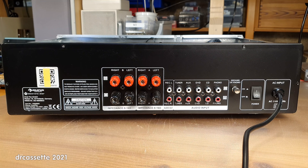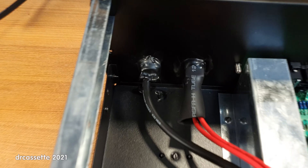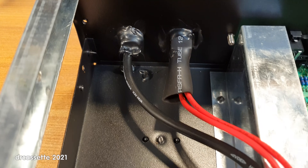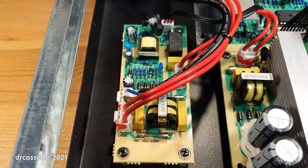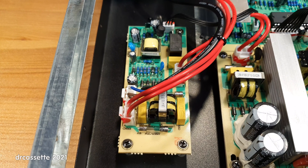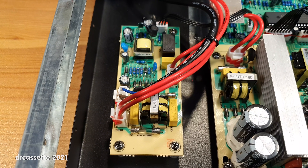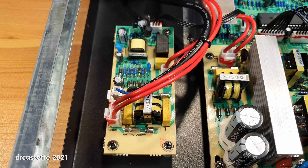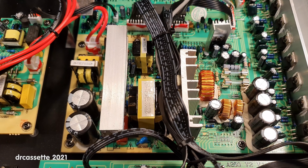Because this device is only from 2014, everything is nice and clean inside. Mains power comes in over here via a non-grounded but fairly substantial power cord. That leads to a small switch mode power supply, which provides a 5-volt standby voltage — and in standby mode, a constant whine. This is quite a noisy switch mode power supply.